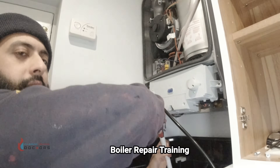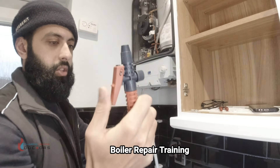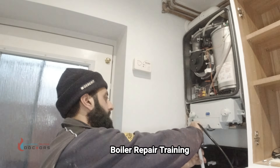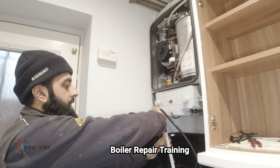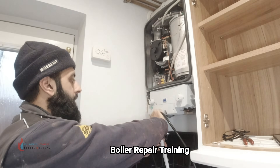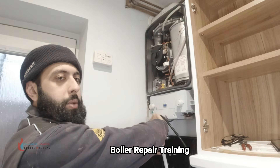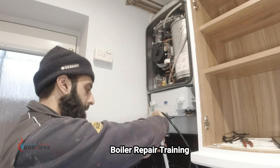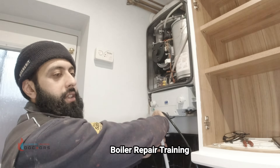What I'm doing now is I've put a foot pump on it, poured about two liters of water in there, and I'm draining it through while watching to see if the water backs up. If the full two liters goes through with no problem, I know the issue is sorted. The last thing you want is to unblock a condensate and then get called back a week later — it's happened to me once, and now I always make sure the whole route is completely clear.